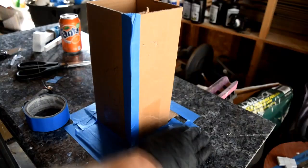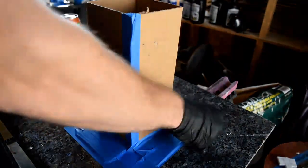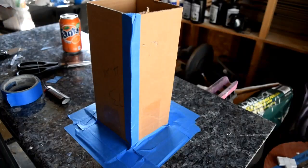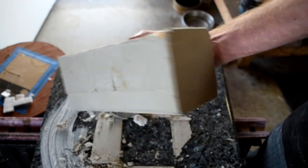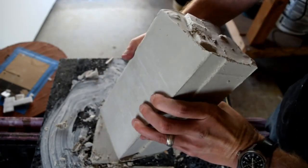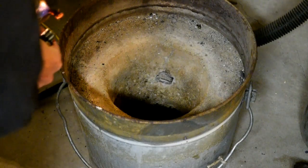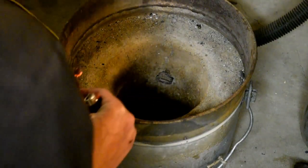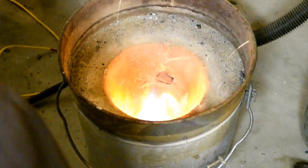Here, I'm just taking an ordinary box and taping it to my work surface. I'll then put my 3D printed model and sprues in the box and fill it with a 50-50 mix of plaster of Paris and silica sand. I actually did try to film me pouring that in there, and unfortunately it didn't record — and the reason it's unfortunate is because it was hilarious. The tape actually sprung up and plaster started spilling everywhere. In the end, I got it.